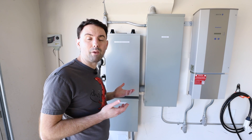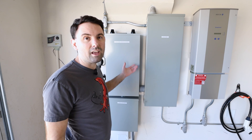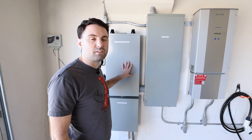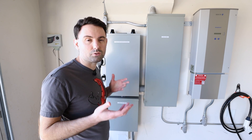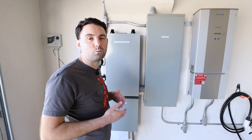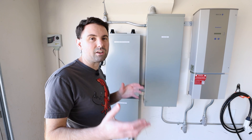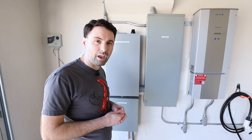Power from the grid passes through the meter outside, then through the 200 amp main outside, and then into this box right here. One of the key parts that's in here is the contactor, which can serve to isolate the house from the grid — which both in a grid-down scenario prevents the house from feeding to the grid, which could endanger line workers, and also prevents the house from functioning essentially as a generation site when the grid goes down, which could be very bad.